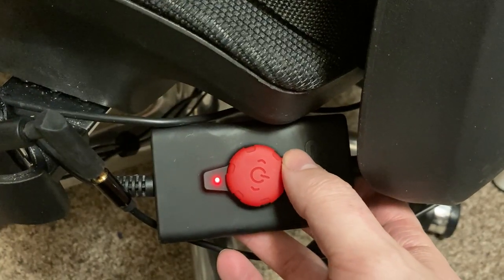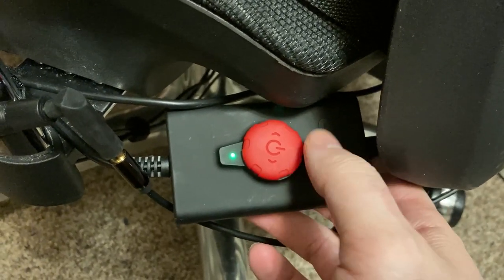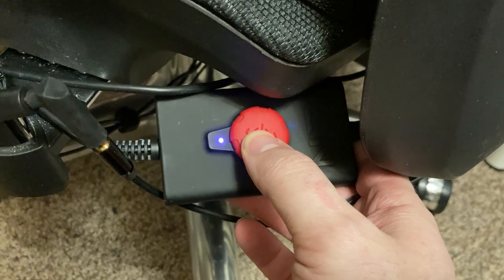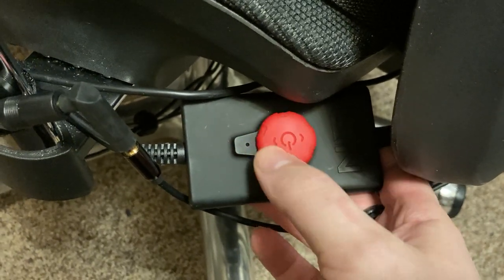On USB mode, you've got all your different settings adjusted. You can turn it all down or all the way up to 100%. To change modes, it starts in USB mode as a solid color. In the most intense mode it'll be red; in lower intensity it'll be greenish. Hold the button and it'll turn pinkish and start blinking. After about five seconds, release it and it'll continue blinking in the relative intensity color.